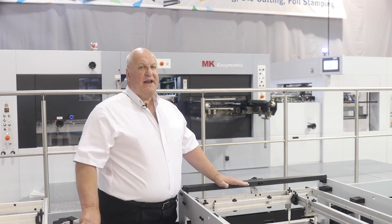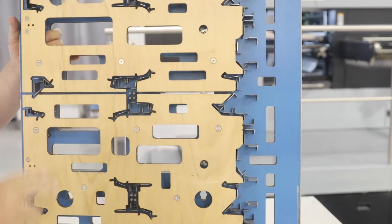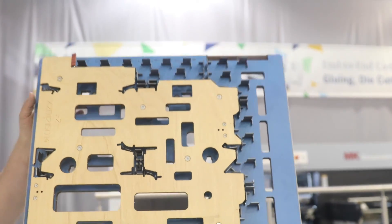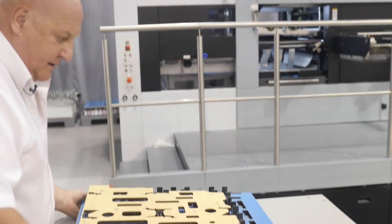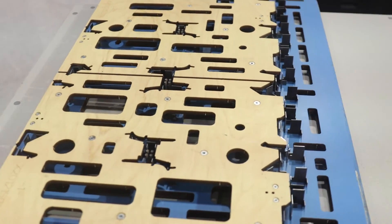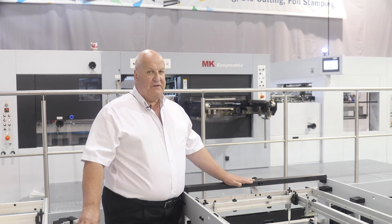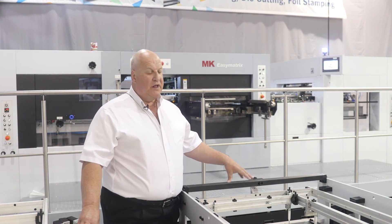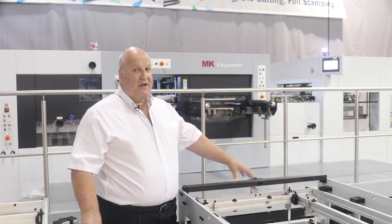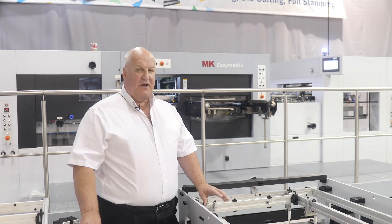Finally, I would like to mention the use of dynamic stripping tooling. The concept of dynamic stripping tooling is to eliminate the use of bottom pins entirely. Through careful design of the central stripping tool with restrictions built in and special upper pins, the waste can be punched out effectively without the use of any lower pins. While this can be achievable, we do find that in many cases a few pins may be required to ensure reliable removal of some pieces of waste. Even so, if a setup can be made with just a few pins positioned and mounted in the machine, a lot of time can still be saved.